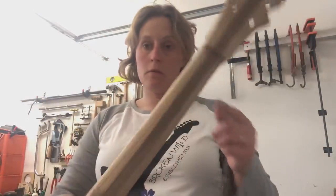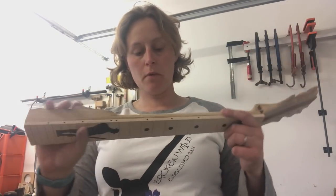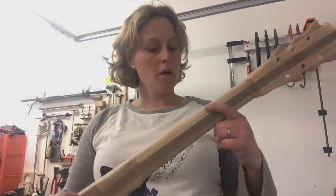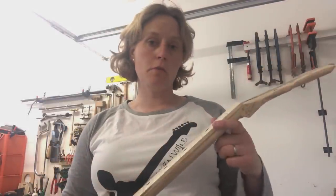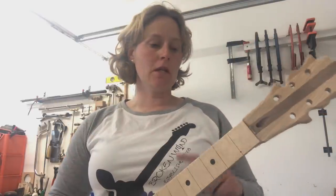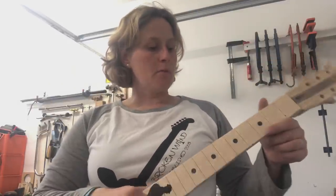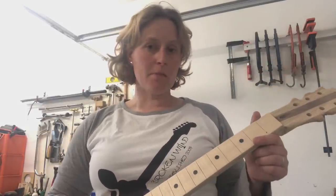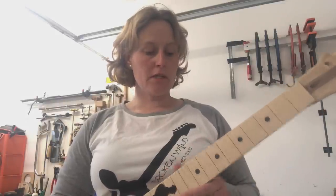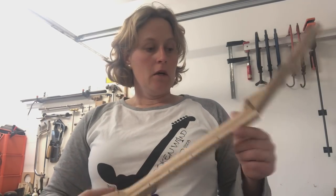Right, well, we have a neck. You need to do the volute and the heel, but shape-wise, pretty pleased with that. It's a technique that I saw Ben do before I did the last build, which was my bass, like Dennis the Menace. I was watching one of Ben's videos on him building a P bass, and he marked the neck out by doing lots of small facets and then joining them up to make the curve, and it just makes sense to me. It's logical, it's quick, it's easy, and it's got pretty good results. So yeah, shaping next, and then joys of sanding.